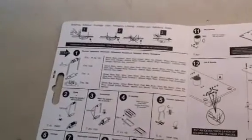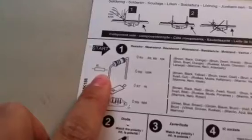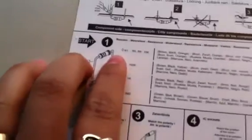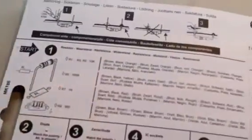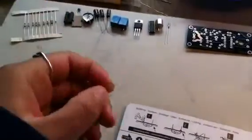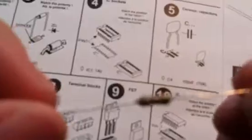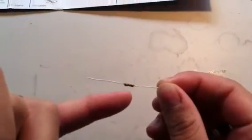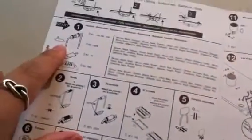So let's get this thing going. We're going to go back to our manual and look at our instructions. The first part of completing this particular project is step one, which is the resistors. They give you nine different resistors. Resistors 1 through 5 and R8 have a striping that is brown, black, and orange. I'm going to look at this resistor right here — this is an R1 through 5 resistor — and as you can see, the striping is brown, black, and orange, which lines up with the diagram in the manual.